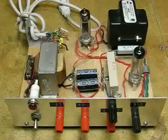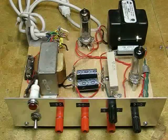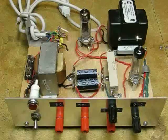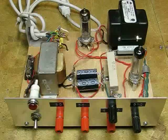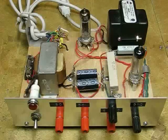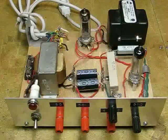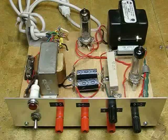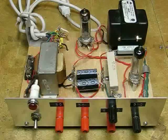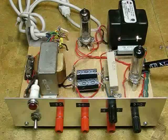And here is my little stand-alone power supply. Of course it is fuse protected. On the front panel I have a pilot light, on-off switch, and binding posts to provide the different voltages. This little power supply will give me 150 volts DC regulated for my receiver's detector circuit, and 300 volts DC for other tube circuits, along with 6.3 volts AC for the tube filaments or tube heaters. My rectifier tube is the 6X4, and the voltage regulator is the OA2. Again, breadboard technique has been used.